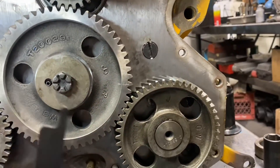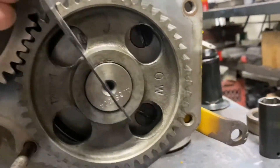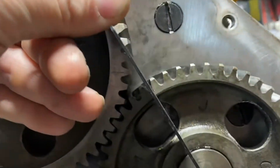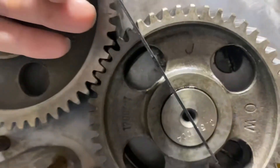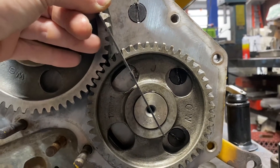In this case, all we need to worry about is the injection pump and the camshaft. We take the JD 254A tool, find the centerline of that hole, rest it up against the crank, and the timing mark should go right over it. See — boom — that's in time, perfectly in the center.